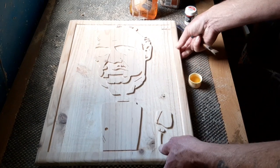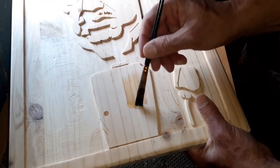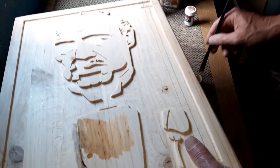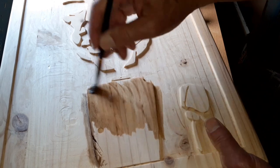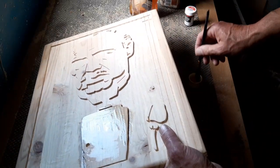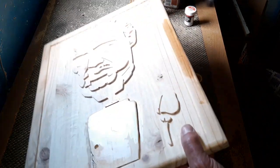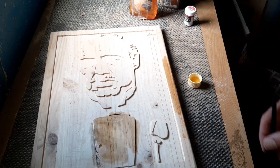There's your boiled linseed oil — just a case of brushing it on like so. You can see it darkens the wood down nicely. You don't need too much, just enough so it soaks in. Get down those side bits — doesn't matter what we put on the back there because the resin will cover most of that. Give it a nice good coating and the same with the framework, not forgetting the side bits — that will come out a lot nicer.